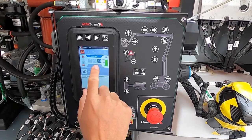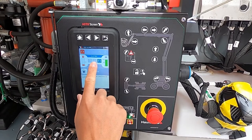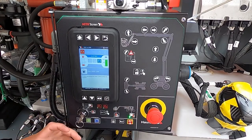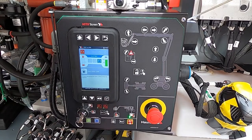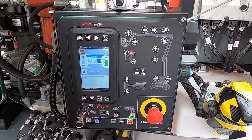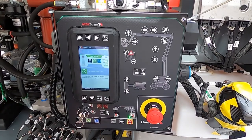Next we have what mode of operation you have. There are three modes of operation on the HA61LE: engine on all the time, automatic mode, and battery mode. Battery mode is the default on this machine. This is an electric machine with a range extender engine, so you can see it has defaulted over to the battery system. For the operator to run the engine — if he wants to charge up the batteries using the range extender — he would activate the automatic mode.